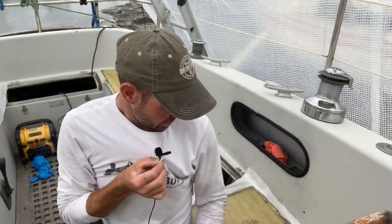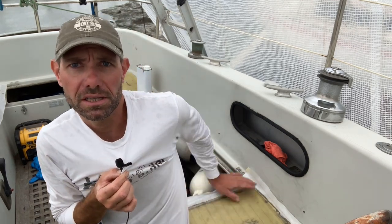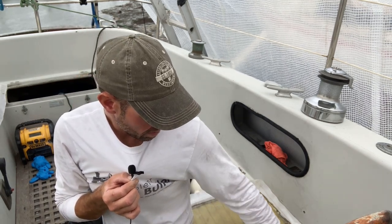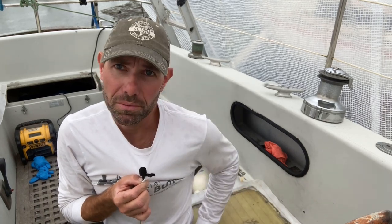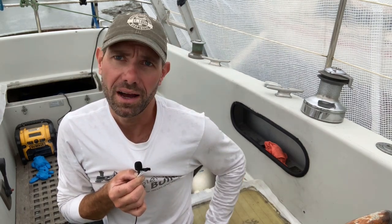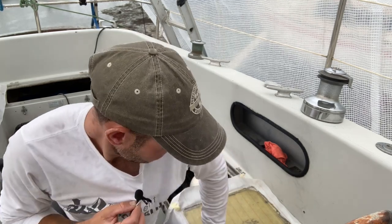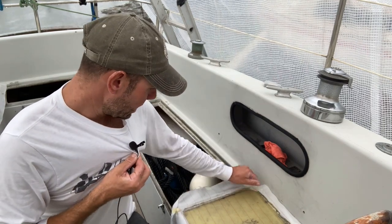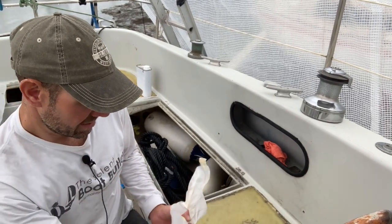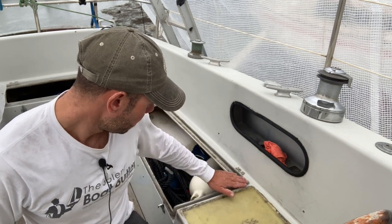I'm back on the boat and as you can hear the rain cover is doing its job. I'm going to remove this peel ply and then start filling in these pads with some epoxy mixed up with some low density filler. It's going to take probably a couple of fills to get to a reasonable surface. But first we have the very pleasing job of pulling off the peel ply — we just tug it at the edge and we end up with a lovely clean surface with a texture on it, all ready to take the next layer of filler.